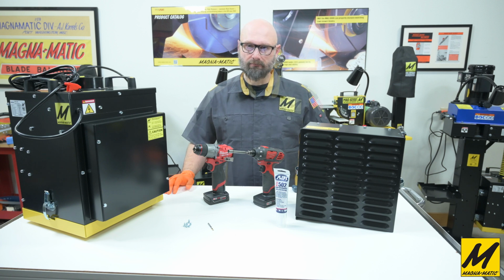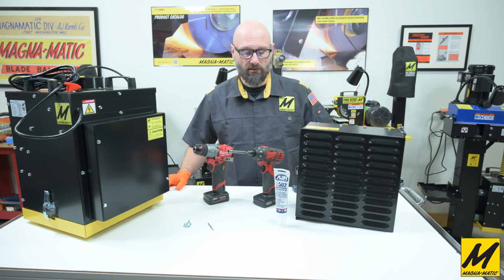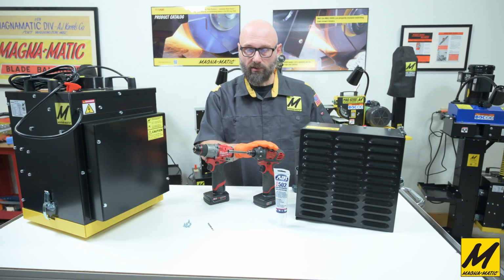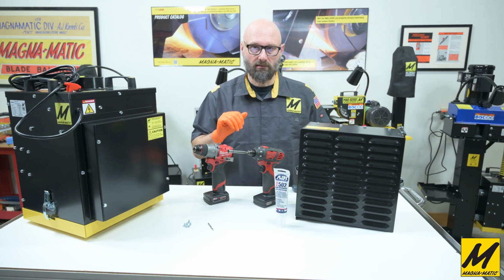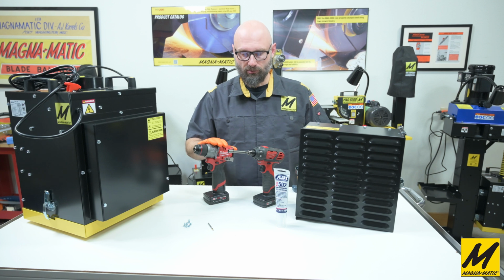This Shroud update gives you the ability to use a 4-inch deep filter and a full 12 by 12 MERV 8 pad. Some of the tools you'll need for this installation are a driver with a 5/16 socket, preferably one with a magnet in it. That makes it a little bit easier. You'll also need a drill.